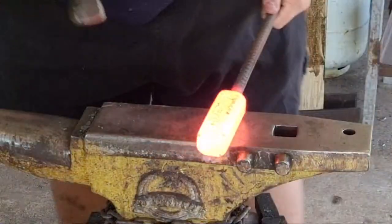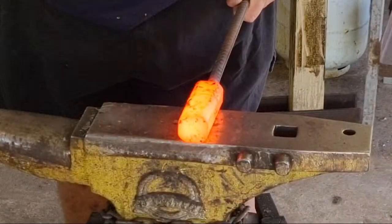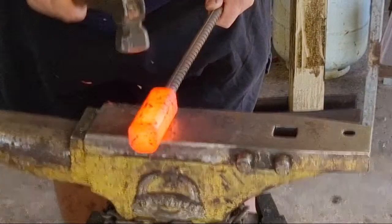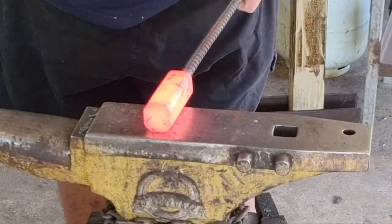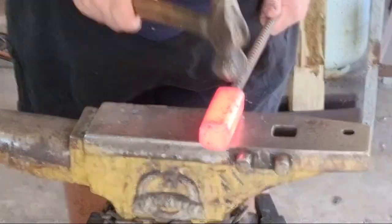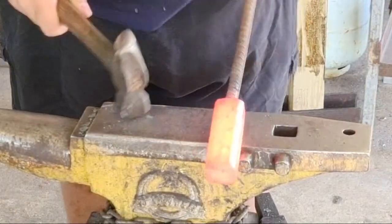Okay, we're just going to do a truing pass with Bob's hammer. You missed me swinging yours, Hans. I'm just using Bob's to flatten up the work I did with yours. Slightly lighter, slightly flatter hammer. Not a flat hammer though. So many people make the mistake of making hammers flat. It's a bad idea.